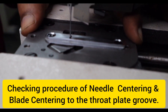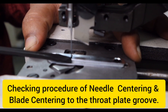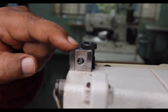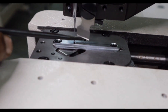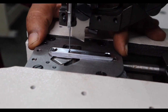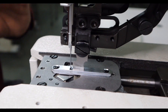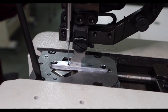If the needle is not centered, just move the trimmer plate front and back and make sure you are fixing the needle center to the needle plate hole. Also press the blade from the top of the lever and make sure that the blade goes inside this groove. If it is not correct, move this plate and make sure that the blade goes to the center of the throat plate hole. Then tighten the screws of the trimmer plate.